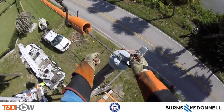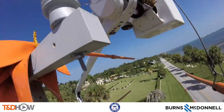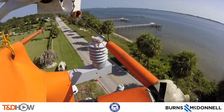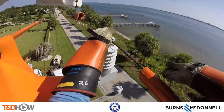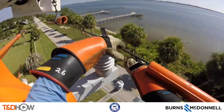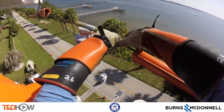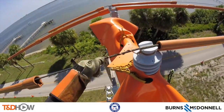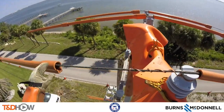Here we see that same process on an outer phase of the line. He's removing the copper wiring from its old insulator on the wooden cross arm, bringing it up to the new insulator on the fiberglass cross arm, setting that in place, and then using those copper wires again to tie in this line. He slides the line sleeves or guts back over this portion of it. We also see a view of the third phase of the line being tied into the new cross arm on top of the concrete pole.